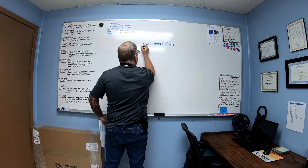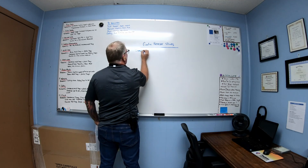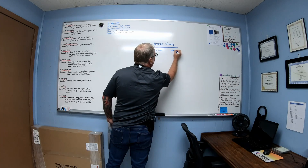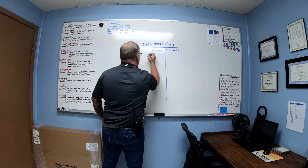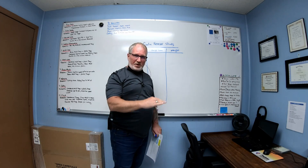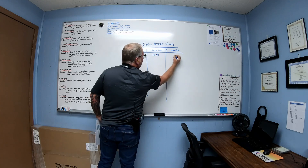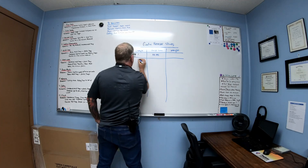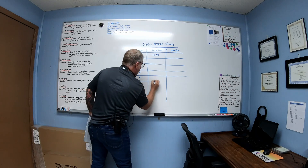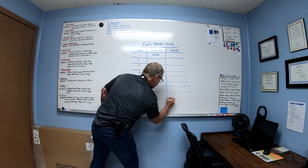So what you're going to do is set up three columns. You have a sample column, you're going to have a hold time — or pack time, that's up to you — and then you're going to have the weight. What I usually do is get the process optimized to where you're running good parts, and then you take your hold time. Start off at like ten seconds for sample number one, put your weight, then continue across samples two, three, four, five, six, seven, eight.